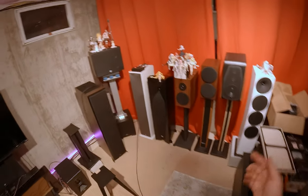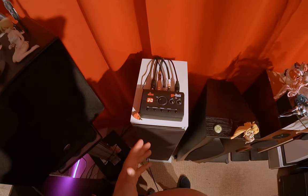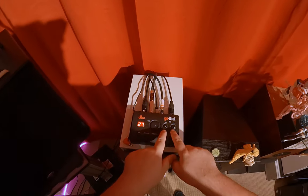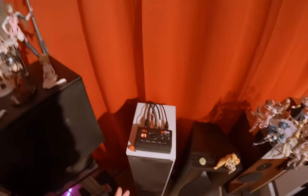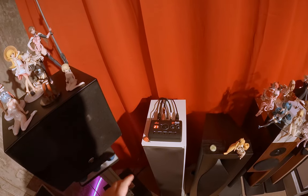You could buy the opposite adapter to turn XLR back into RCA female and use another short RCA to plug into your sub. What's happening here is this DBX GoRack — I should explain what it is. The simplest explanation: it has two XLR inputs, two XLR outputs, a volume control, and a balance adjustment. It's also got subsynth, EQ, compressor, anti-feedback, and mute functions. It used to cost around $130, and if you had powered monitors on your desk you could just intersect your DAC and have a digital volume control with a nice readout.